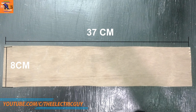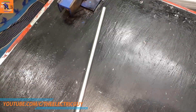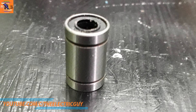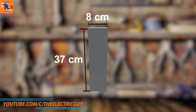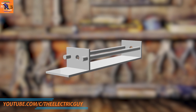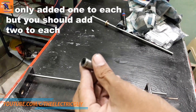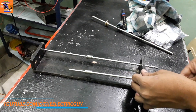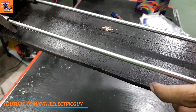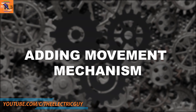For the axis, you require a wooden base plate, a wooden piece with 3 holes in it, 2 steel rods of 35cm, and 4 linear bearings of 6mm. Now attach everything like this, and you can see the measurements for the attachments. You have to make a total of 3 axes of this kind. Add the steel rod in the assembly with 2 ball bearings in each rod, then measure the distance between the rods — it should be the same at all places.